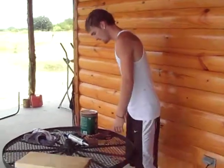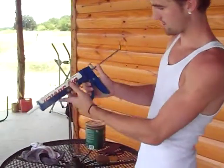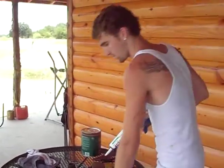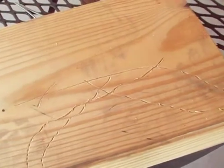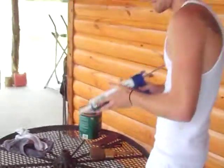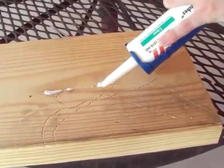The first step is caulking all the cracks. We have our caulk gun material — the way to hold this caulk gun is just like this. You pull the trigger and you stop it to stop the flow of the caulk. If you look at our sample board, we have these cracks in it. You really don't want to paint that because all of the paint will leak inside these little cracks and you're going to have a weird looking board. So you put it at an angle with the cut and you slowly squeeze the trigger on all these lines.